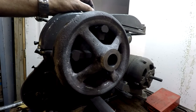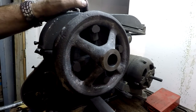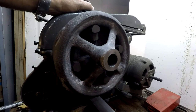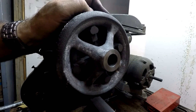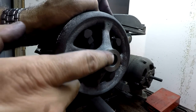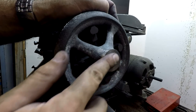The next order of business is cutting a keyway, but unfortunately I don't have a set of broaches or a press — the lifelong quest for tool shopping continues. I'm going to have to go to my buddy's house and borrow his broach and press, but he doesn't like anybody filming over there, so we'll have to come back for that. When I broached the last one, I'd already drilled the set screw hole and it chipped out just a little bit — not enough to ruin it, but you'd like to avoid that.